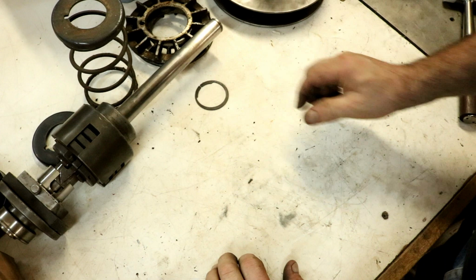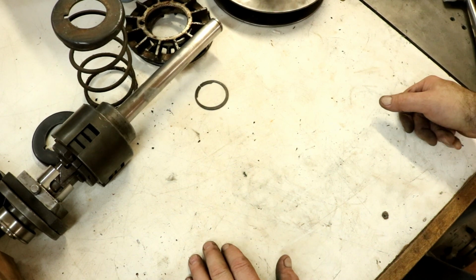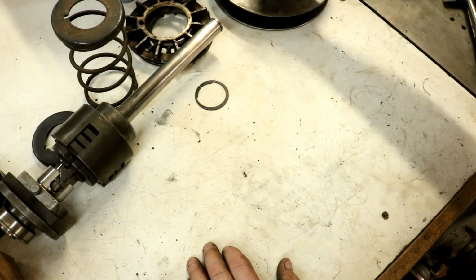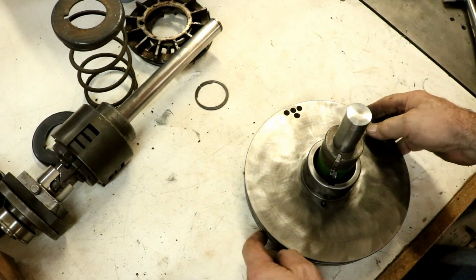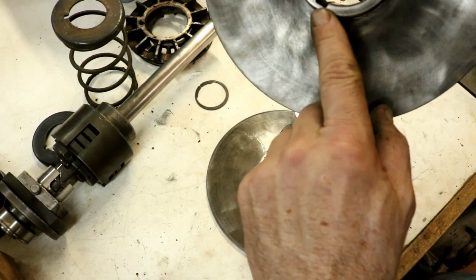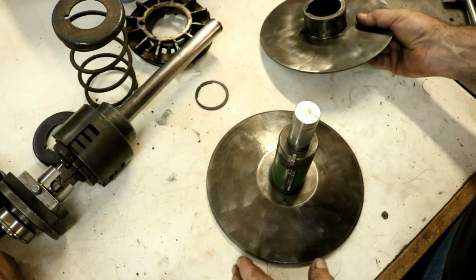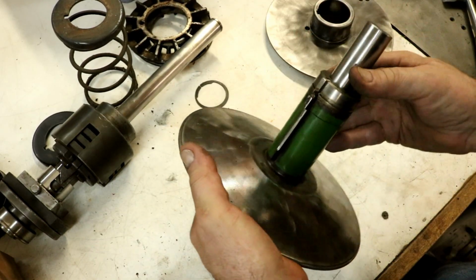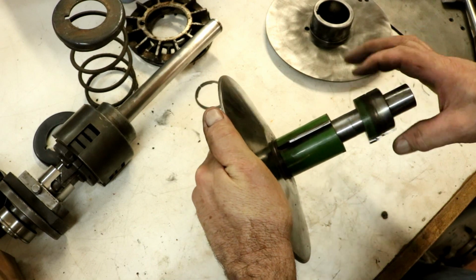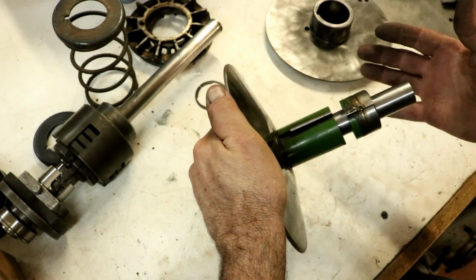Well, my friend Dale Deary was helping a guy clean out his shop back east, and he came across some parts for a Clausing lathe. And so he shipped them all to me. I bought them from him. Anyway, I was going through them, and well, here's the right size pulley. I cleaned this all up. I go, well, it's kind of screwed up here. The keyway's all been wallowed out, but not undoable, and I could put a new keyway in. So I could have fixed that, but this piece is kind of different. Here it has the anti-seize coating, has a key in it, which is all worn out, but it came in 2 pieces. Somebody used the old Tony method and karate chopped that right off of there. Why'd they cut it? Who knows?